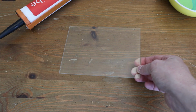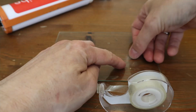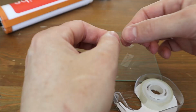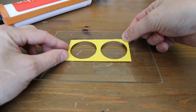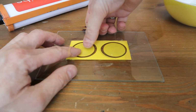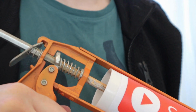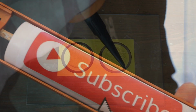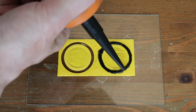Glass can be of use when you want to make a mold for silicone caulk, which seems to stick to anything, and when cured it's highly flexible and fairly strong. Perfect for making some custom reproducer gaskets. But removing silicone from a 3D printed mold can be a real challenge. So if you can make one part of the mold from something extremely smooth, you'll make removal just a little bit easier.